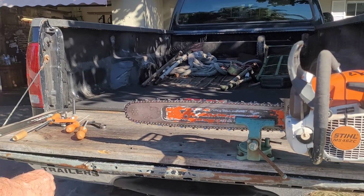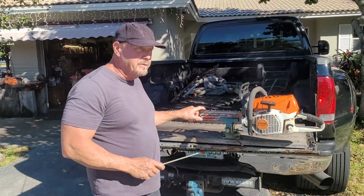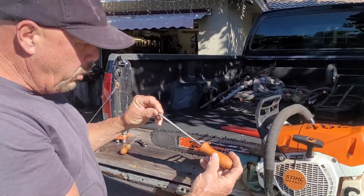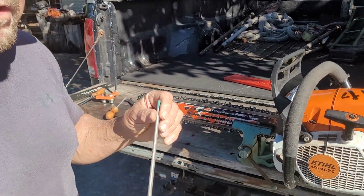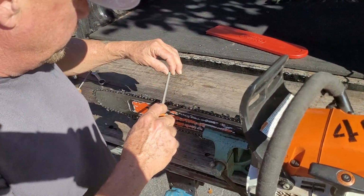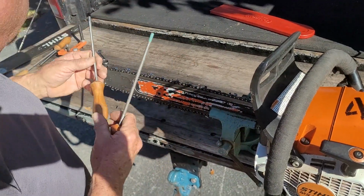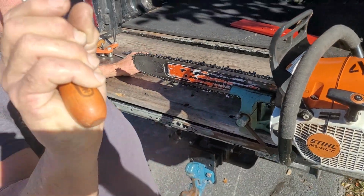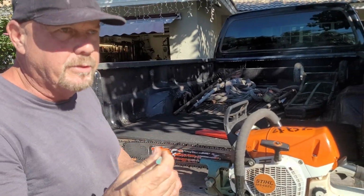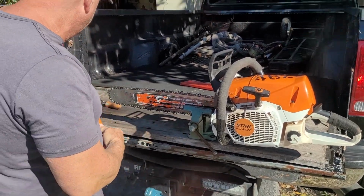Okay, like I was saying before, say you really gnaw your tooth up on something. I use a 1/4 inch file, which is actually a 404 file, and you can move a lot of material quick. And then you can cruise back down to your 7/32 and get your edge. You know what I mean? So you got about this much that's all peened up. This is just a technique that you can move metal quicker. These last longer and they move more metal.